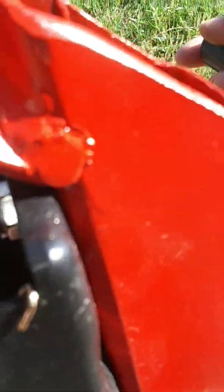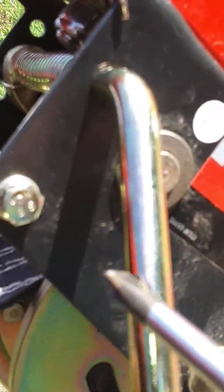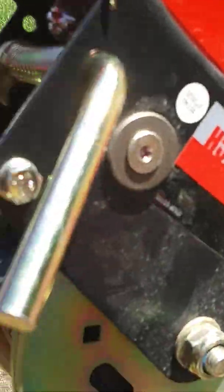Watch what happens - it's not made to keep it locked; it is spring-loaded to release. If I take my hand and pump that lever right here, it's gonna automatically unhook. See that? It automatically unwinds - there's no safety. All you have to do is pump this lever right here - just a quarter inch. Bump this lever. It's not spring-loaded to stay safe; it's spring-loaded to kick it into neutral. There it is - bump it. You bump that lever, it's locked... but you bump this lever right here and it automatically releases. There's nothing anywhere to lock this.